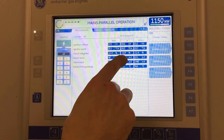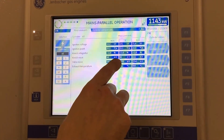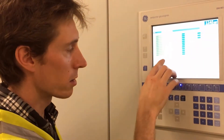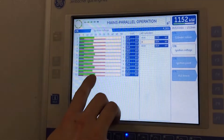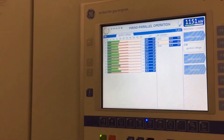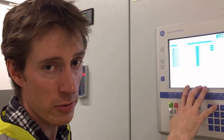It shows in terms of percentages: knock noise, which is the millivolt measurement of the transducer on the block itself, valve noise, and exhaust temperature. There's a graphical representation of ignition voltage — you can see the relative differences between each cylinder. For example, if you had one that was particularly higher than the others, you would expect that to have a worn spark plug or a spark plug with a bigger gap. The red indicates the limit, so they would need changing or at the very least re-gapping — GE would always recommend changing.